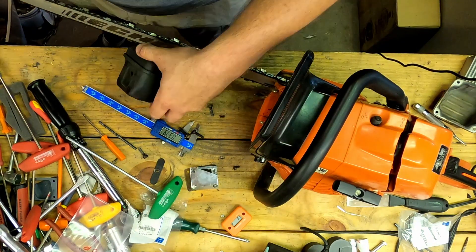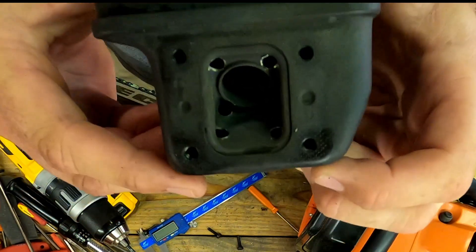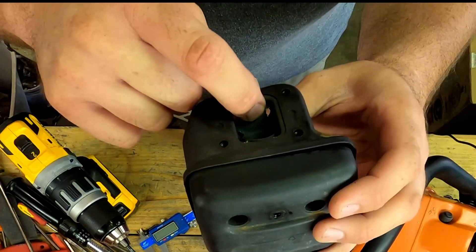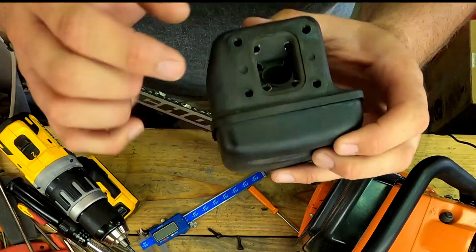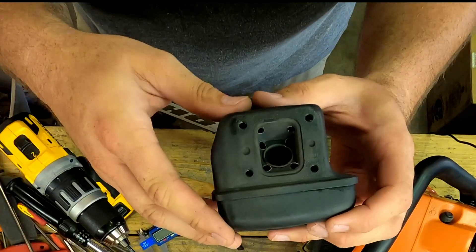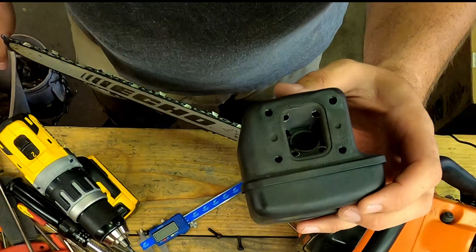Here's what we're starting with, and here's what we ended up with: six holes total — one each quarter around the main tube, two in the back. I don't put a hole in the center; technically that's a good way to get flow but it's much louder that way. This keeps it a little bit quieter, where most of your flow comes in deflecting off the backside deflector before turning and coming out. These two holes in the back — if you made these any bigger they would definitely create more noise.